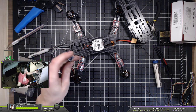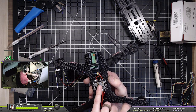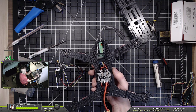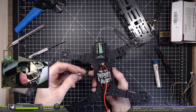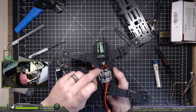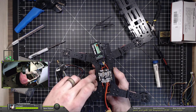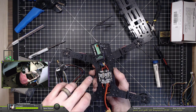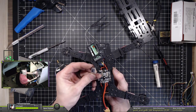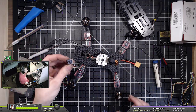Well, battery voltage will be on a separate pad coming directly off of this. So we'll tap into this pad over here, which is unmonitored. Probably about a year. So this pad here is another 12, like a non-filtered. So all the ESCs get pure unfiltered battery, basically battery in, battery out. All of these chips and stuff are the BECs to control the 5 volt, 12 volt steady sources, the LED controls. So we'll basically run right off of these battery ports back here into this chip, and we'll get straight battery voltage into this chip without any sort of reduction, because that would be pointless.